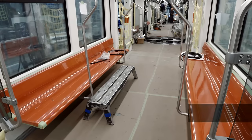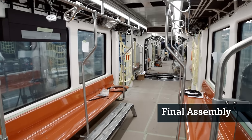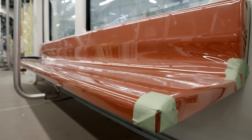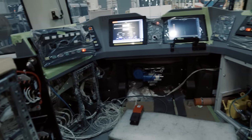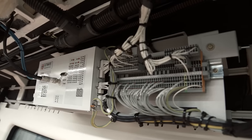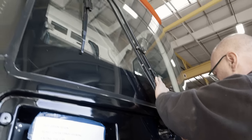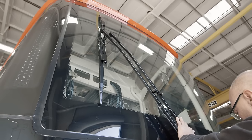After the roof station, we bring the vehicle into our final assembly area, where we put everything else in the vehicle. We put the interior fiberglass liners, we put the seats, we put the cab wall, we put the dashboard, we put the operator seat. We take the car from a stripped-down version to a fully assembled version with everything in it that you see on the S200 vehicle when it's shipped to the city of Calgary.